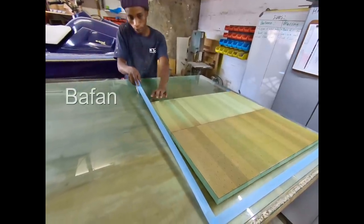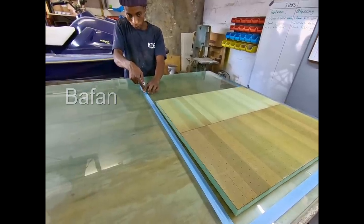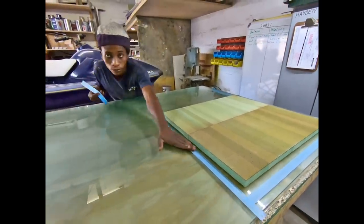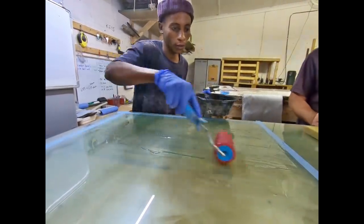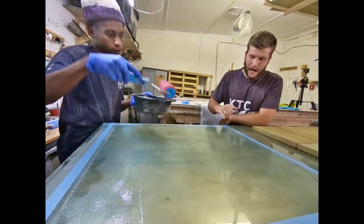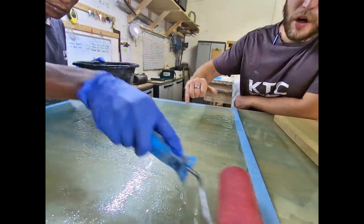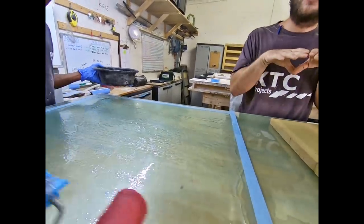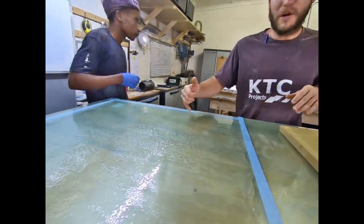Hayden has made hundreds of these fiberglass foam panels. First he defines the area with blue tape so he knows exactly where to roll out the polyester resin, then lays down pre-cut sections of chop strand mat and roving. Then it's a quick roll-out of a thick layer of polyester resin. You can see how the resin is pulling away from the wax in some places because of the viscosity — the thinness of the resin means it can't hold to itself.